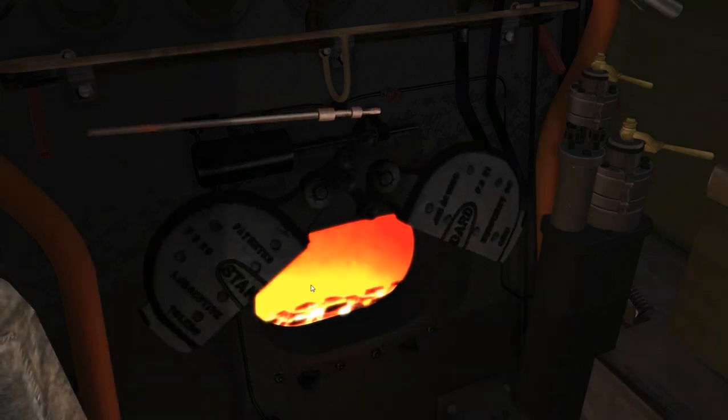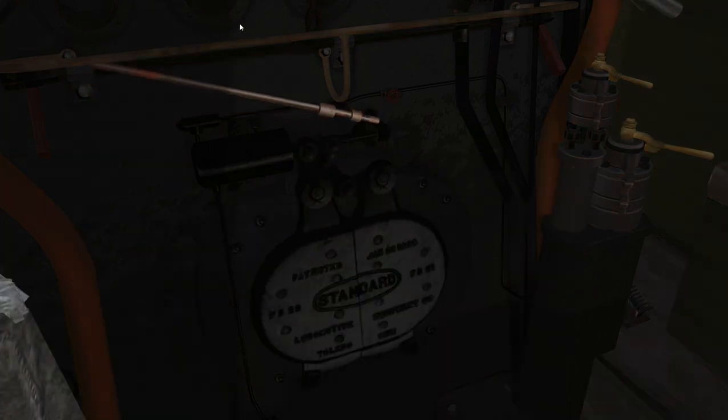So there we've got our firebox doors that we put up there on the... What do you call that? Butterfly doors. I thought it said something else. But, yeah, tilt pull down on it. We open it up, and there you see nice little heel at the back of the firebox door, which is pretty much what you would have. Down here on the floor, this is the foot pedal that you would actually use to open that. This is air-actuated. There's your shakers over here and over here. There's our damper. We're going to go ahead and open that up. That's underneath on the ash pan.